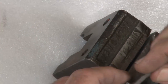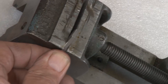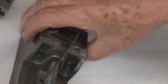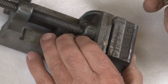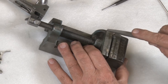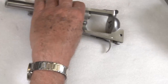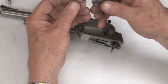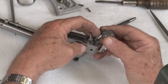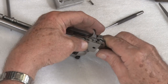It's just trial and error. We have to put that in the vise. Then we get a file — a Barrette file is a good file to use on this — and you keep the same angle that's on there. We don't know if we got enough off or not, but it's strictly trial and error. So we put the pawl back on the hammer, pull the trigger forward, put that in there. See this plunger on the hammer? You can depress it and it'll slide right in. All guns won't do that, but most of them will.